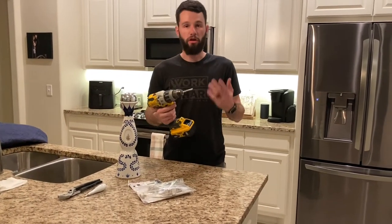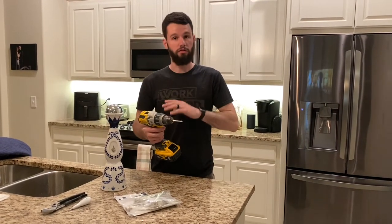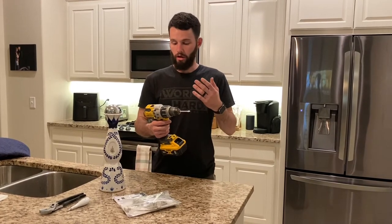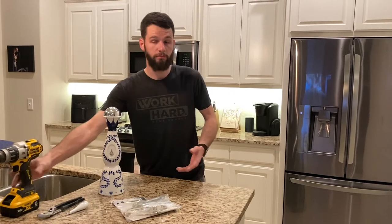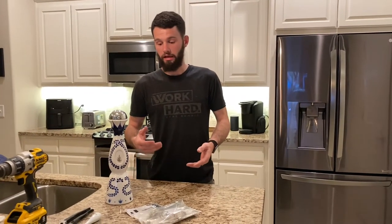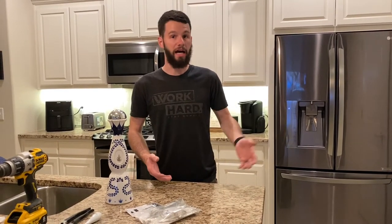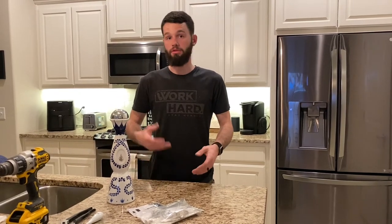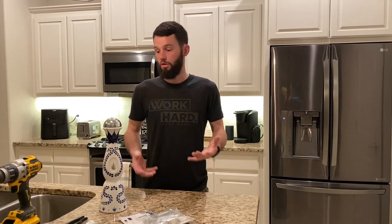We are using a hammer drill but not the hammer drill option — just use a regular drill. We tried it at the slowest speed; it needs to be more around medium speed. In some other videos they use water, and even though these bits say water is required, I never use water when I drill into tile for bathroom anchors or towel bars.